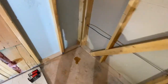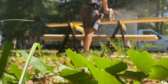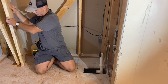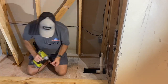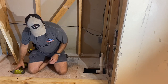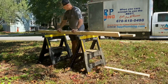Let's take a look at this cavity right here where the fiberglass unit was. You can tell there's a pretty thick mortar bed right there, so we're going to have to do a little bit of framing. The two main goals of the framing are to raise the floor up so the tub will sit flush with the tile, and then to throw that wall out behind us — because that fiberglass unit was actually two inches wider than the steel tub.